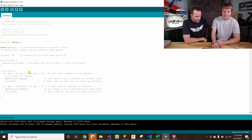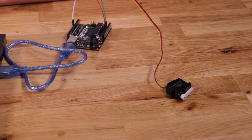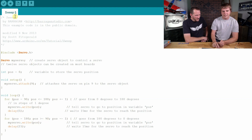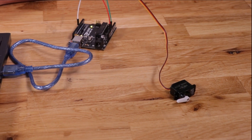Another example: let's say we don't want to go to 180 degrees — let's say we just want 90. I change the comparator so I'm saying as long as position is less than 90, and then change the starting position here to 90. Upload that code and we should see a much shorter sweep. If we want the other side, instead of going from zero to 90, we go from 90 to 180, with the starting position set to 180 back to 90. So now you're sweeping between 90 and 180 degrees. Upload that and the arm should switch over to the far side and sweep 90 degrees on that side.